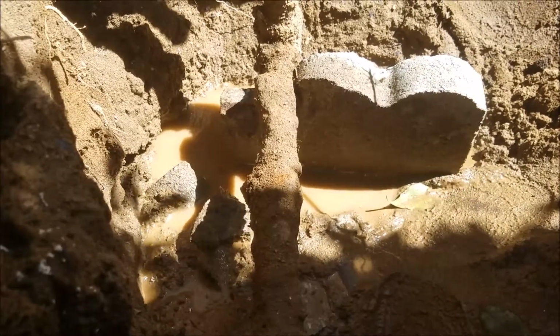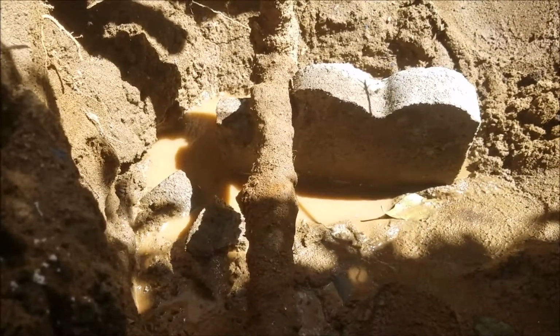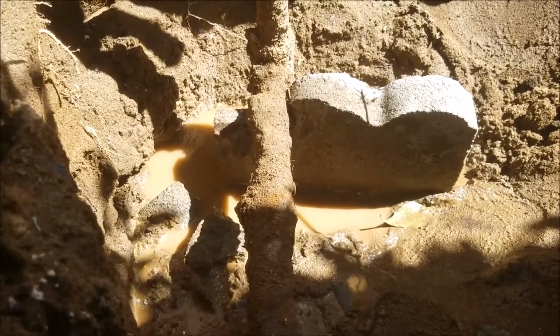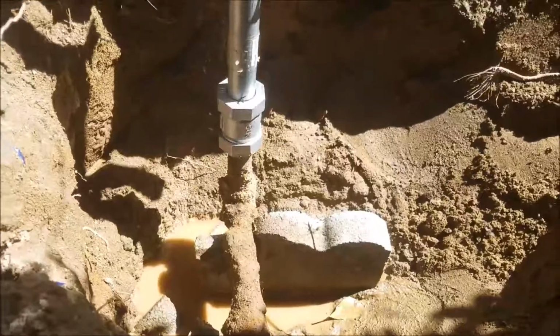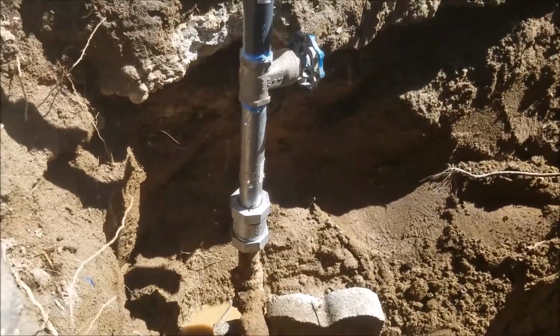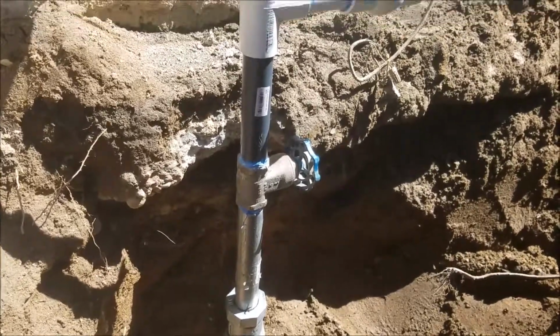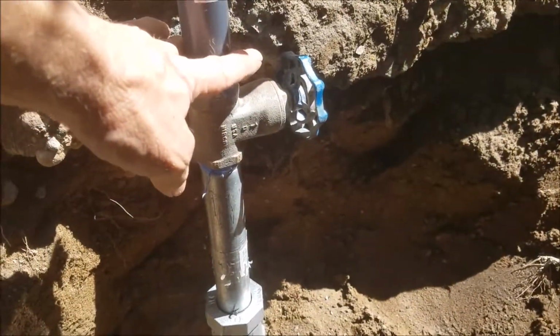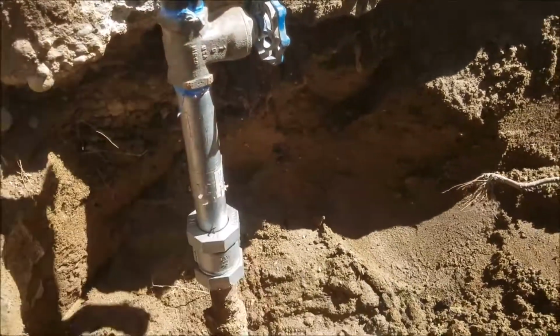There might be PVC, but we couldn't find it, and we dug back about 4 feet and hit this sidewalk right here. So any further trouble, we will not work on this or repair this. We will recommend a complete repipe from the meter over to the house, and then this would all go away. It would get cut back here, and new PVC would get tied in, and all this junk would go away.